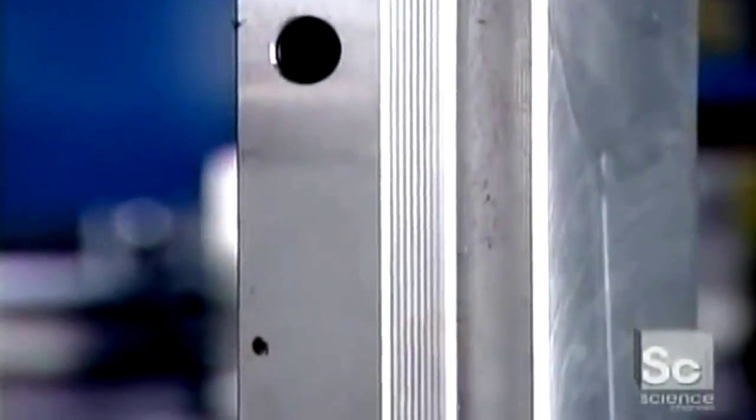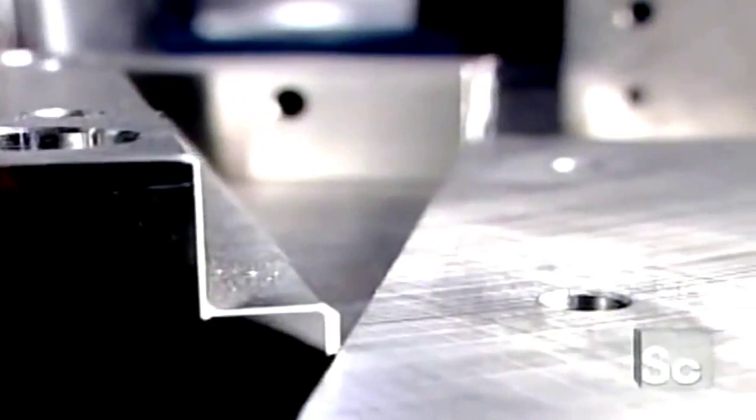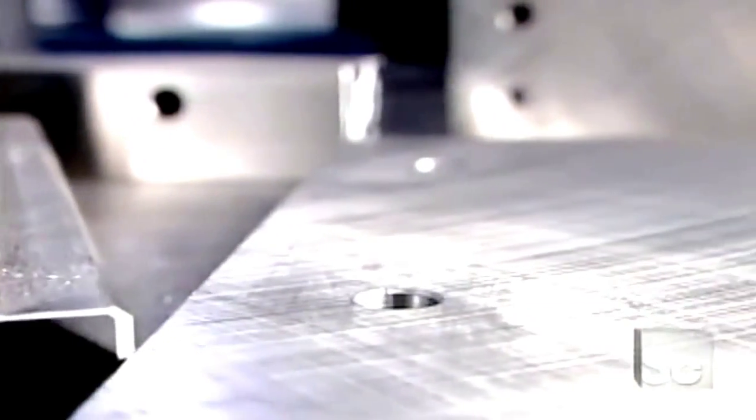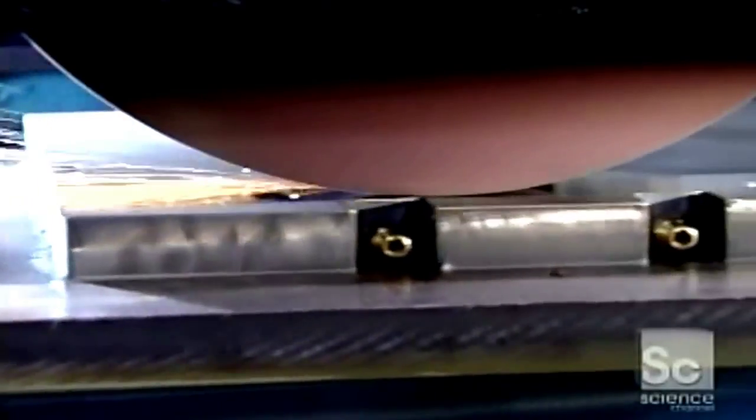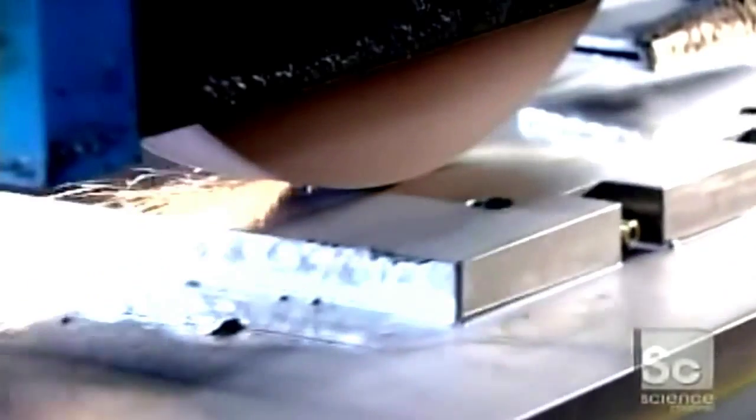A mold usually consists of two halves, each of which is comprised of several components. The factory drills strategically positioned holes in each base for the guide pins and bushings that hold the components together when the plastic's injected. A grinder now goes to work smoothing and leveling all surfaces. This prepares the base for the high-precision machining operations that will transform it into a mold component.